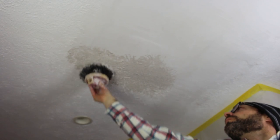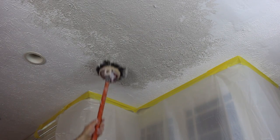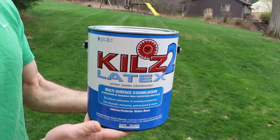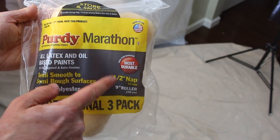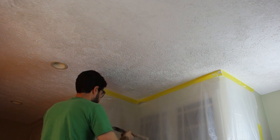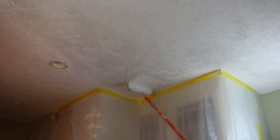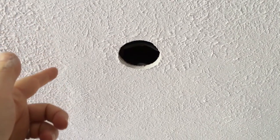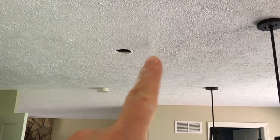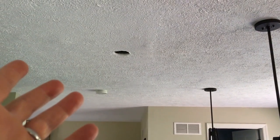I like having a test piece of drywall to apply the texture brush until I get the consistency that matches the texture on the ceiling. You can stamp this by hand or put a pole in the end of the texture brush and stamp your ceiling like I did here. Then you have to prime the drywall and joint compound — one of the best primers is Kilz. I'm using a half-inch nap roller for the texture on my ceiling, cutting in around the cabinetry first, then rolling on primer and painting over that with flat paint. You can still see a bit of imperfection, but I'll live with it.